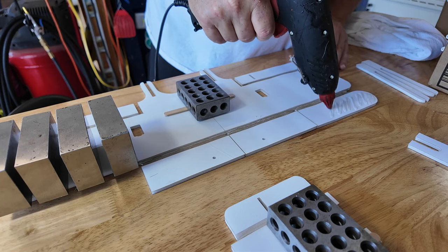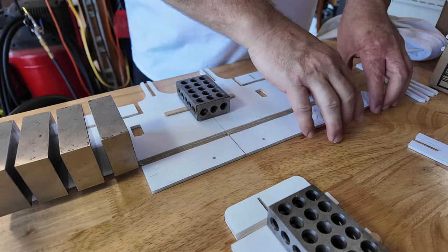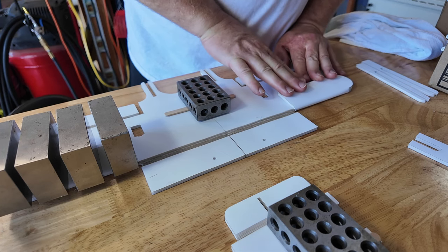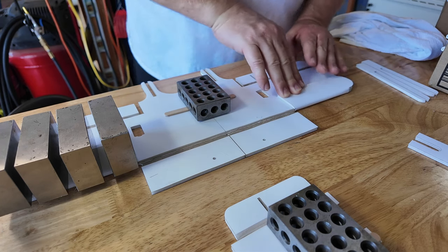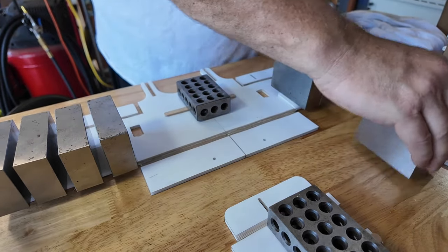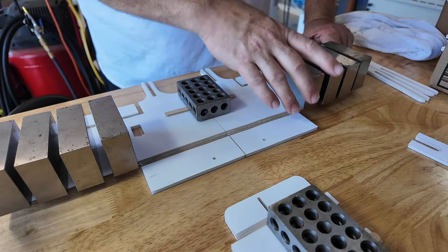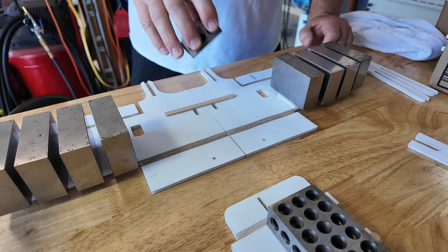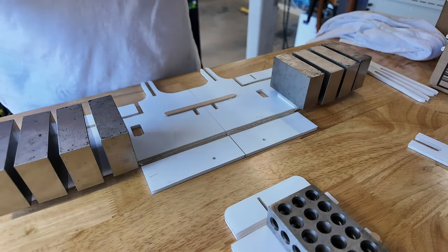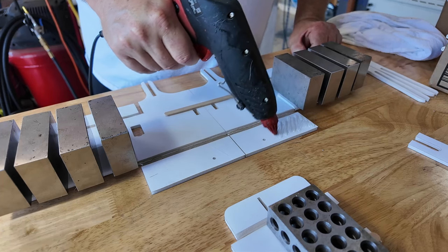Still warm here in Arizona. A couple of storms passed through and the humidity is a little higher than I want. That's come home and you're ready to do some cutting and build some stuff. I don't like running the laser in times of high humidity. Remember, it's liquid cooled. You get that tube chilled down to, I usually run mine sub 20 degrees C. And there are times that that is past the dew point. And if you start getting moisture forming and saturation on your laser tube, that thing runs at 26,000 volts. And you're setting yourself up for a bad day.